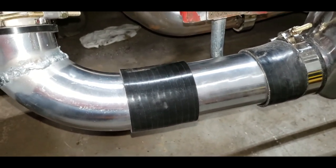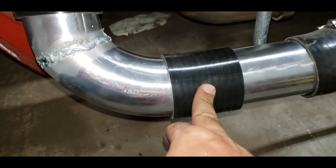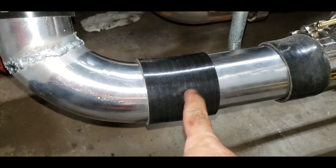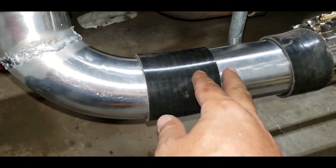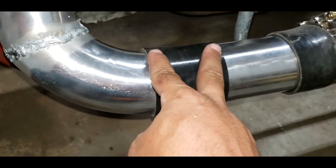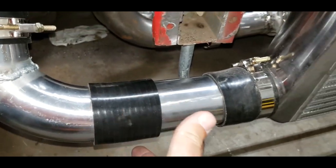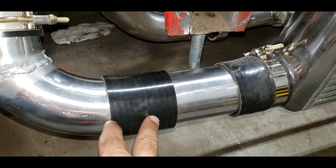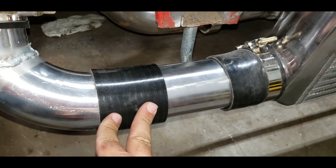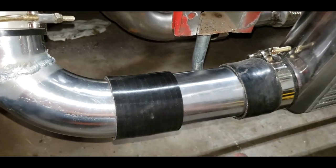So, of course, I'm gonna notch these pipes here with a little handmade tool I'm gonna make later, probably next video or so. But I'll show you how to put a groove or a dimple on this pipe all the way around, so that these T-bolt flanges here will actually grip this coupling a little better. And then when we're all done, ready to start the car, we'll spray that with hairspray on the underneath side, the aerosol hairspray. And it acts kind of like glue, and it's just flammable, so if it ever comes loose, it'll just burn. It won't, but if it ever comes loose, it'll just burn.